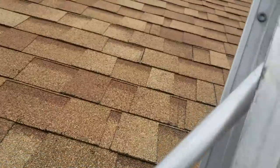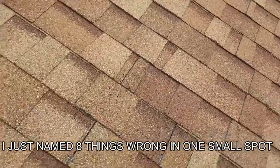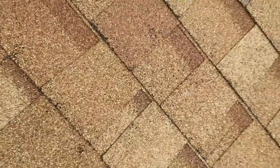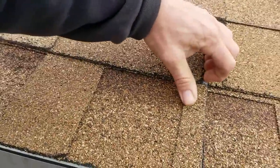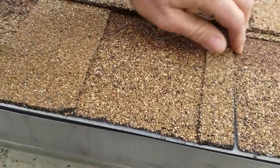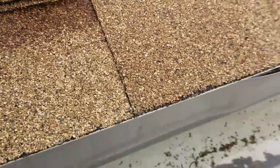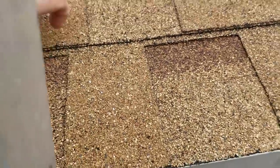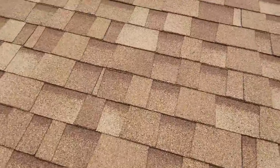She's correct. I don't even really need to see much more of this roof — it was done incorrectly. Did that shingle just lift up? That shingle lifted up. Is there no nails in this thing? There can't be — oh my god. There might be one in that one. I'm gonna get up here and go check out a few more shingles and see if they're all like that. There's no way he did not nail these shingles.